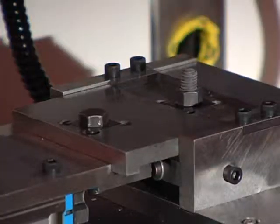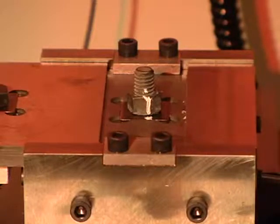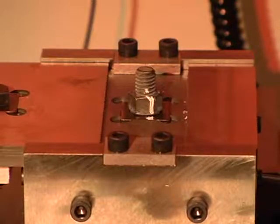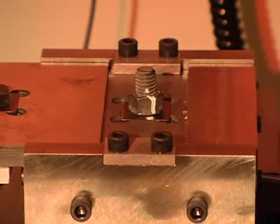According to Gerhard H. Junker, the developer of this test, it is well established that a dynamically loaded joint fails in most cases either by fatigue failure or by rotational loosening of the fastener. Even the fatigue failure is often initiated by partial loosening. Results of the transverse vibration loosening test are useful for the development of bolting strategies which can reduce or prevent the risk of vibrational loosening in service or mitigate the effects of vibration where it cannot be avoided.